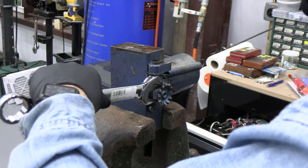We need to get rid of that so we can set our final seal here. So I got all the rubber parts of the seal, but I don't have the metal part out. That's got to go so that this piece will fit in here. We're going to pound it out on the vise. So I put it in a vise, put this pin punch in here, punched through it, and this came out. This should have been taken out with the remainder of that seal.